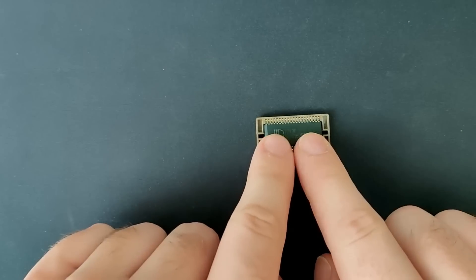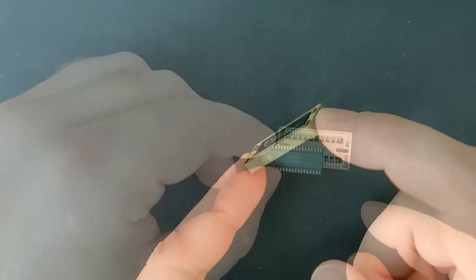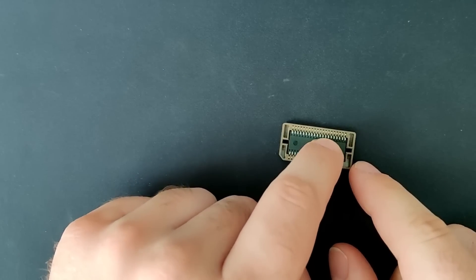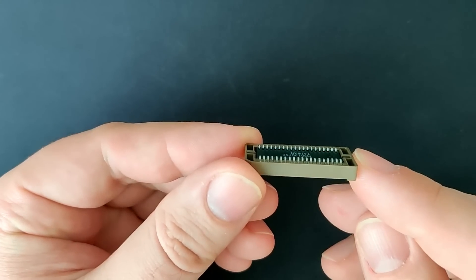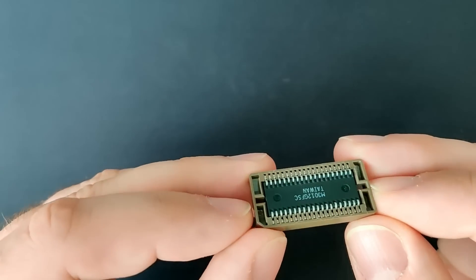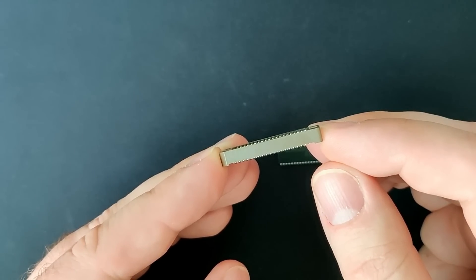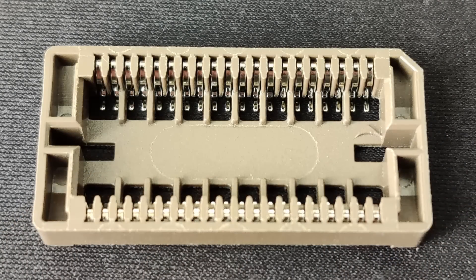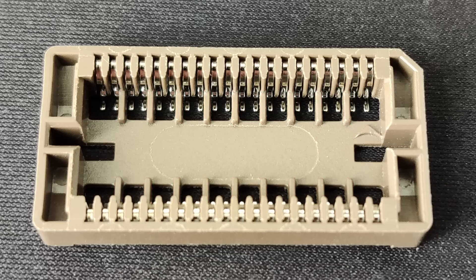When I place a memory chip into the socket it fits perfectly. But when I turn the chip around — which is the case when clipping the memory expansion board onto the existing memory chips of the Voodoo card — the pins stick out, and the chip does not go into the socket far enough to make proper contact or be held in place. When I turn the socket around, the chip falls out. The cause is a support structure that prevents the sides from bending, but unfortunately it also prevents the flipped chip from going in deep enough.